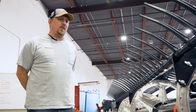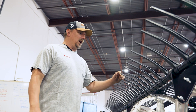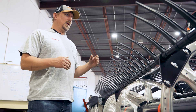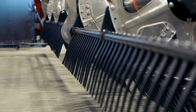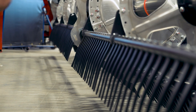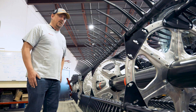In most cases you're going to want to run the cams in the same position — if the left side is in four, the right side should also be in four. Contrary to popular belief, the cam setting doesn't really change how aggressive the crop is in the reel, but it does affect how long the crop is held on the back side. Looking down this reel — one set at position four and the other at two — you can see the aggressiveness of the fingers on the front side is not really different.